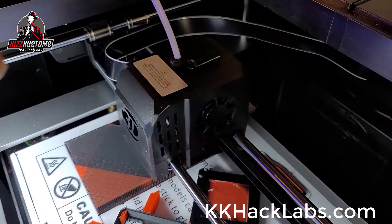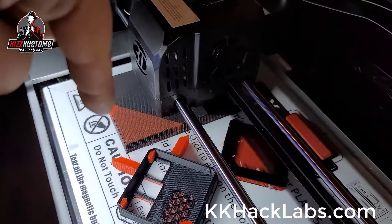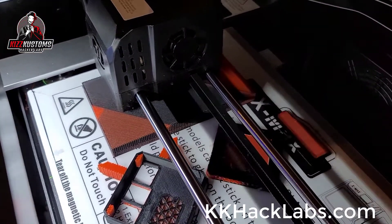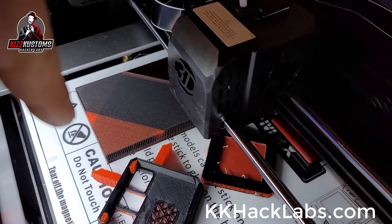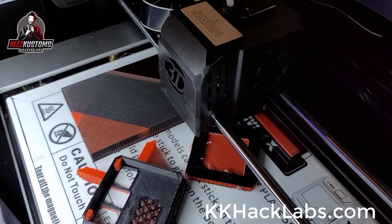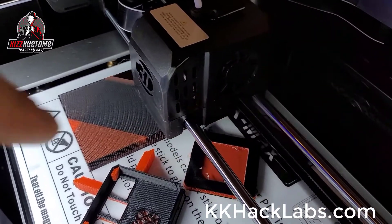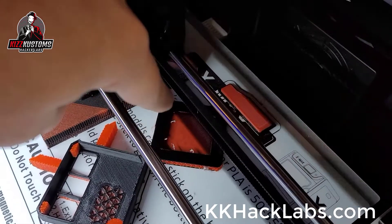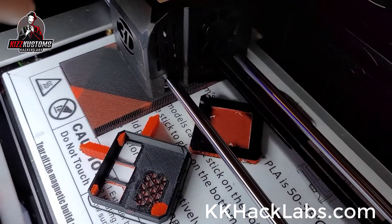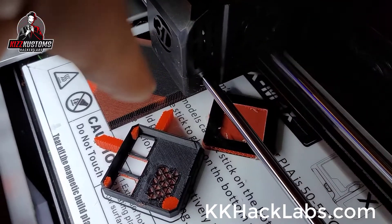A recommendation from the Facebook group was to find a balance between the PETG and PLA temperatures. I'm printing PLA at 220°C right now, which is hotter than I generally print. The semi-transparent red material I use for supports tends to want to print hotter anyway, so I usually do about 220°C. My normal PLA is usually at 205–210°C, and PETG I usually print at 250–255°C. Printing the PETG at 230°C still isn't really hot enough to keep it sticking when it cools down.